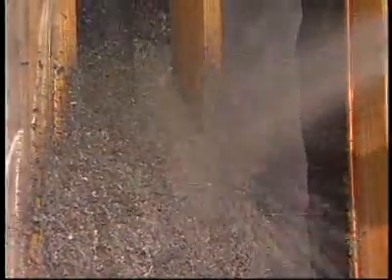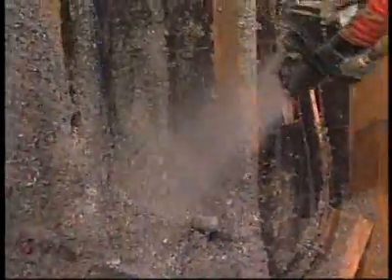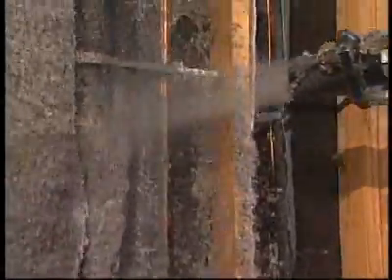Now I have some here. I was under the impression, and I think many people are, that this actually is a lot wetter than it is. But this is really pretty dry. It is — it comes out of the bag near bone dry, and then they add about 25% moisture as it's applied in the wall. And the adhesive that makes this stuff stick is a non-toxic type adhesive. Yes, it is.